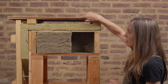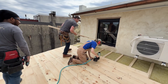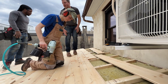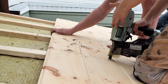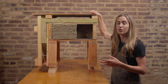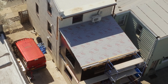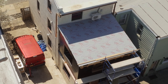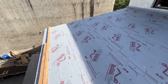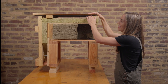We've got our air gap here, and our decking is actually painted pine tongue and groove. The linseed oil painted surface is facing down, just in case any moisture ever got there — a little added protection. On top of that, our roofing team requested a nice sturdy base to attach the metal roof to, so we did let them use the modern heat-rated membrane that they use in their work. Whenever you're working with different teams, you need to find a compromise with what they are comfortable using, so we have a bit of a compromise right on top of our pine tongue and groove linseed oil painted decking.